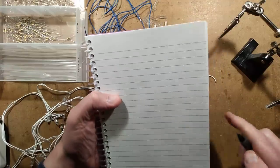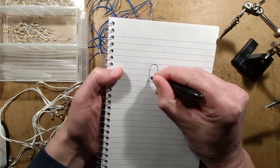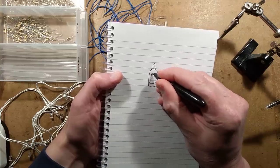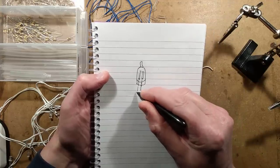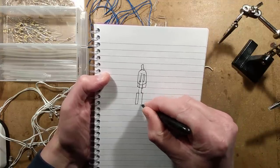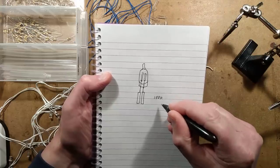The idea is to get one of the little neon lamps - with a little pinch seal at the bottom and a little pip at the top, and the electrodes inside. The electrodes come through and I'm going to cut the wires short and tack on some resistors. Just for ease of construction and power dissipation, I'm going to put a resistor on each lead. The resistor in this case is going to be 100k times 2.